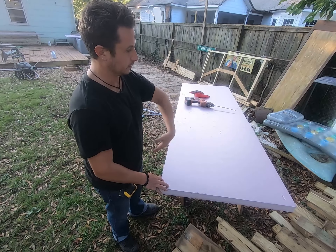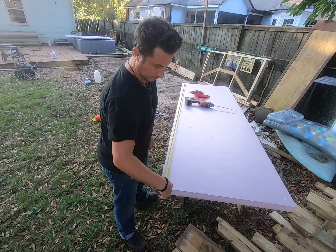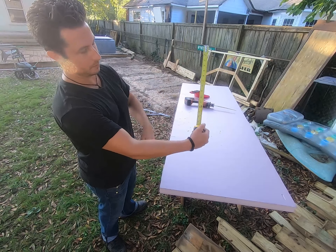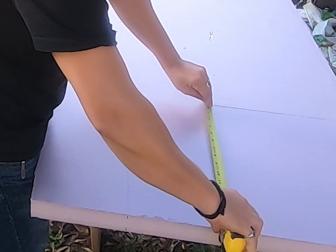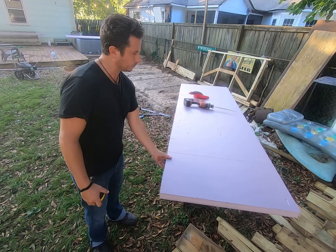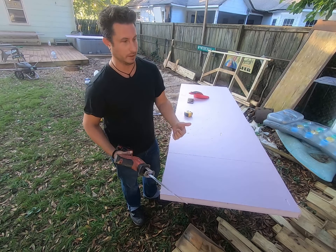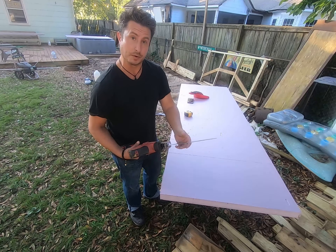This piece is still eight feet. We're going to take it down from eight feet to six foot eight, or 80 inches — so we're removing 16 inches. One trick is to set your tape measure at 16 inches and use a marker to make a line. I moved this operation away from the hot tub to keep the foam bits as far away as possible. Any tool will do — razor blades, Sawzall, jigsaw, circular saw — just know this stuff really dulls blades faster than almost anything else, so don't use anything fancy.